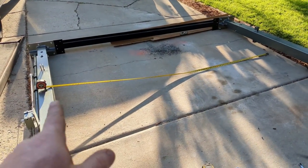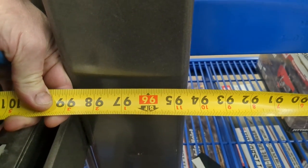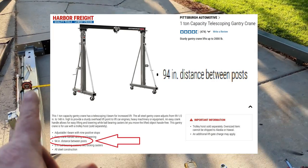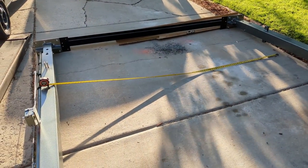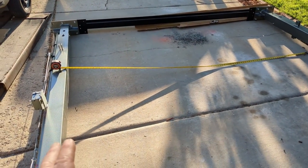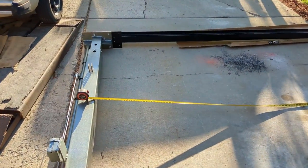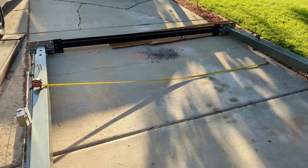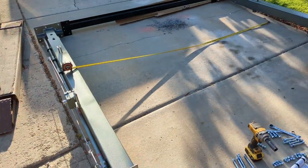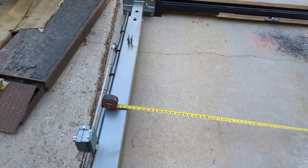I threw a tape measure and I'm actually 105 inches between the posts - I was shooting for 102 and a half. I measured two different Harbor Freights, two assembled ones, and they were 94 and a half inches between the posts. I did not measure this one. Moving each one out four inches: 94 and a half plus eight is exactly 102 and a half. But mine is actually 97 inches wide, so apparently they changed something. Adding eight inches to 97 made me 105, which would be fine except I don't think I can fit it through my side gate now. So I've got to re-drill the holes.